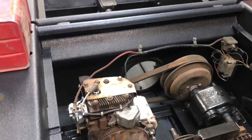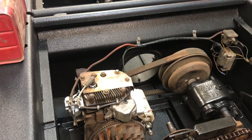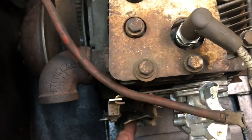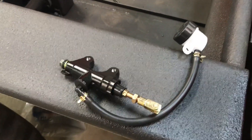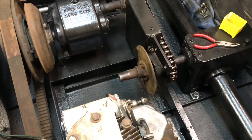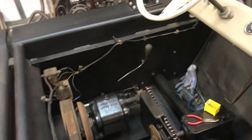Hopefully we're going to have this thing running in the next video. I'm not going to get it running in this video — I've got to tidy up some things and I'm waiting on a governor spring. There's a governor spring right in here that should be here by the 10th. The hydraulic brake master cylinder — we've got to figure out where to mount it, and the brake caliper should be here today. Still need to throw the drive shaft in and probably get a new key switch, and I think that should be about it.